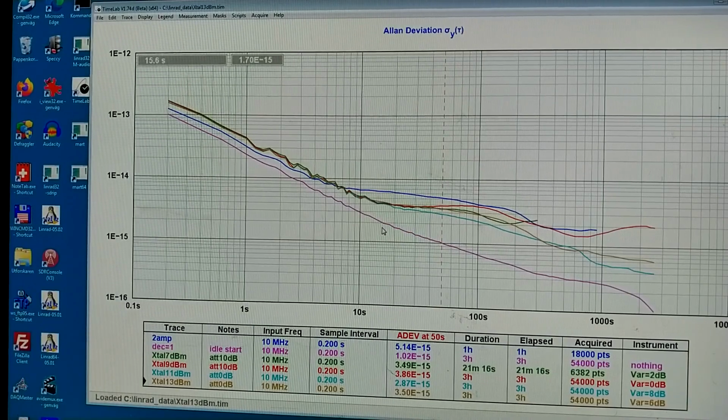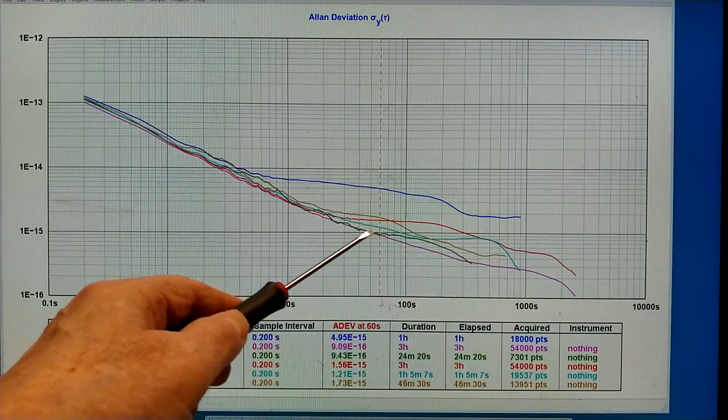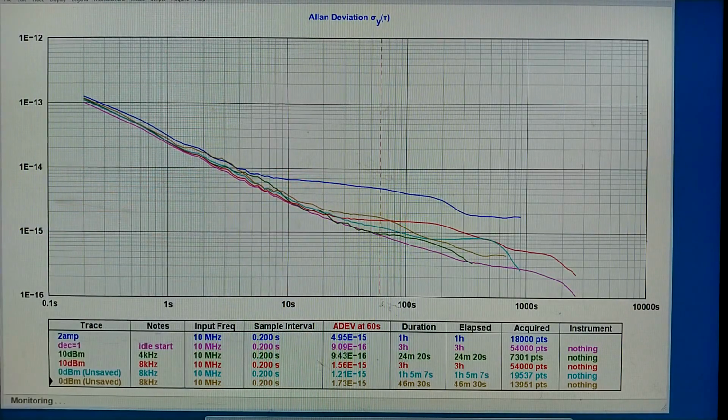I will add some fixed resistors to make the sensitivity of the potentiometer much smaller. Now I've got a problem with the stability of my setup. I can no longer reproduce the nice trace I had here. This blue track is what I had with the crystal filter and the amplifier, but I have seen very good results with the crystal and the amplifier very recently, but no longer.